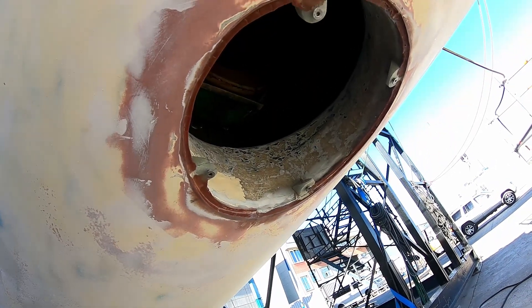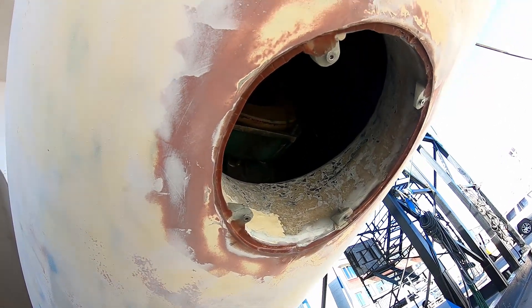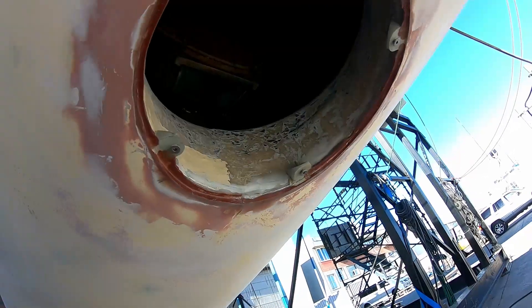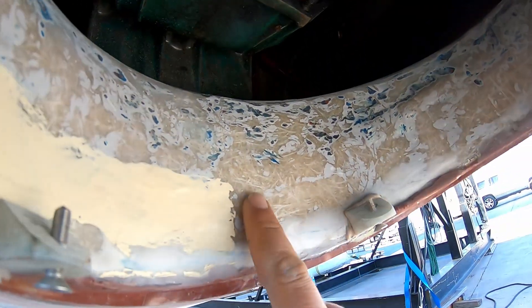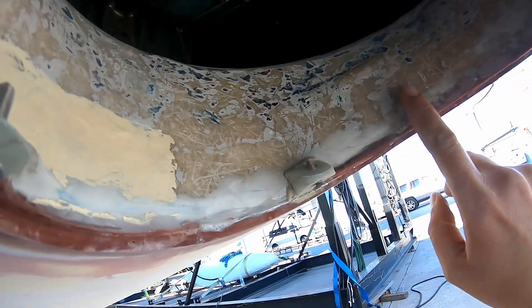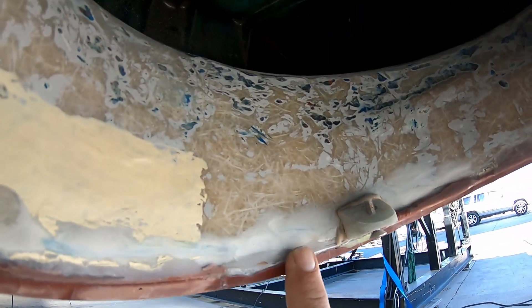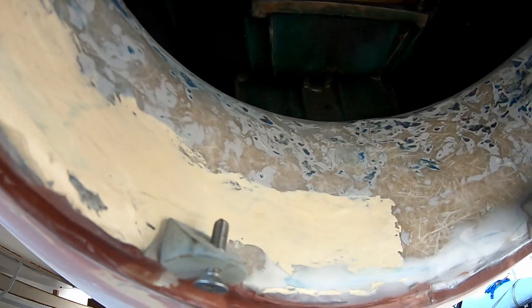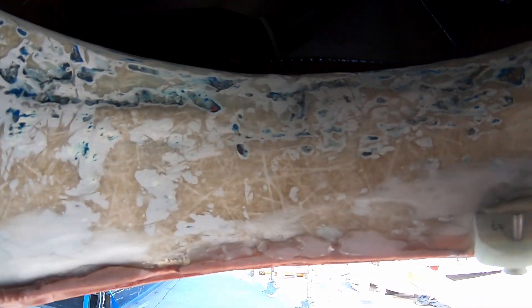Made the new covers to go over the hole, and rubber boots and all the rest. I've sanded this out, so I'm going to epoxy prime all the inside of here and do a little bit of filling and fairing to make my cover look a bit nicer. Most importantly, I'll get a coat of epoxy over this polyester glass inside the sail drive pocket sorted out.